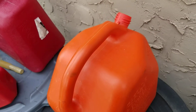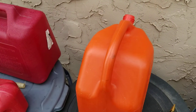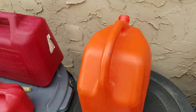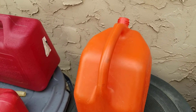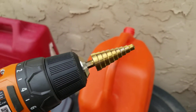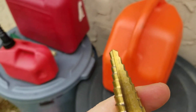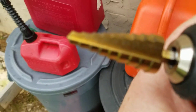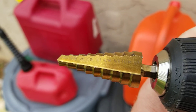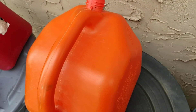The way you install this vent is very simple. You can use a half-inch drill bit, a spade bit (some people call it a paddle bit) that's half-inch, or you can use a reamer — basically called a step bit. It has all the different sizes marked on it, and you can see right there is the half-inch. What I'm going to do is slowly drill it out one step at a time until I get it all the way to the half-inch.